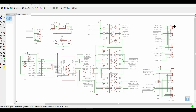The display, as we saw in the teardown video, is making use of probably a couple of sets of 74HC595s, serial in, parallel out ICs, and the idea is, well, that's exactly the same chip that I'm using here to drive the outputs. So we know what the topology looks like, we know how the protocol works. So theoretically, I should be able to read that data.